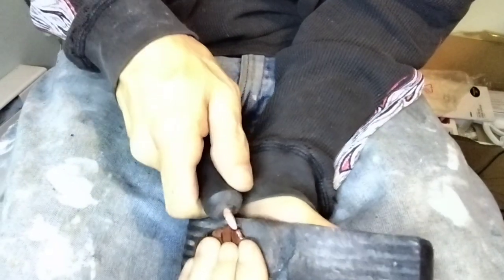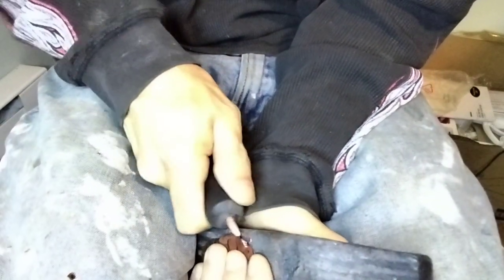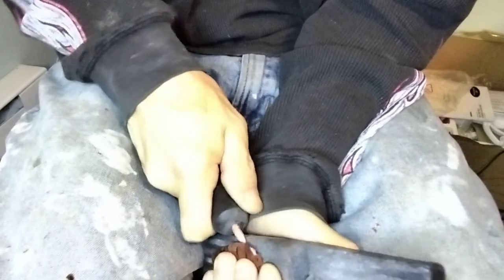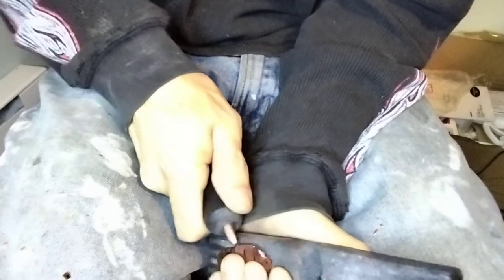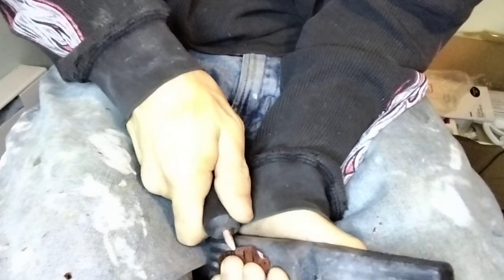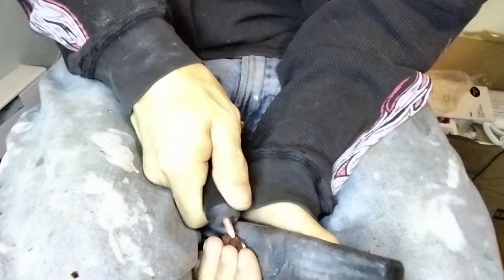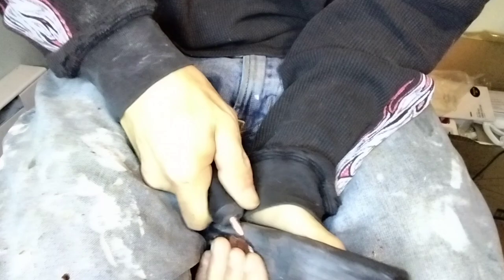We're going to lift this edge. Side B is aiming upwards, so I'm just going to go downwards, scraping down. We're lifting that edge. You can do the same thing by flipping it over to have side A up, and you can do upward strokes, which is the same as downward strokes here, flipped over. Alright, be very easy, be very careful. It's getting thin, it's getting fragile. The thinner and more fragile it gets, the more careful and less aggressive you want to be.